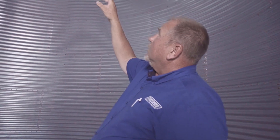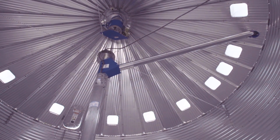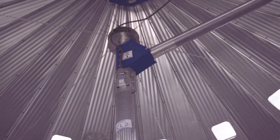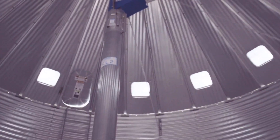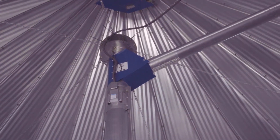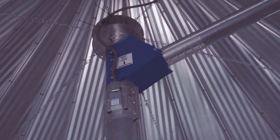We also want to make sure that all of our cables going to our sensors are in place — make sure there are no spots where they're pulled loose from the conduit or off of the chains, and that they're all anchored good. Also, look at the grain spreader at the top of the bin. Make sure the belts are in good shape, and there's a grease fitting on that bearing up there that also needs a shot of grease once a year.